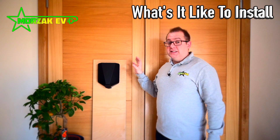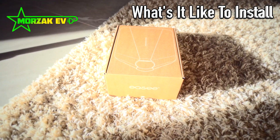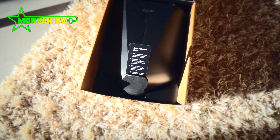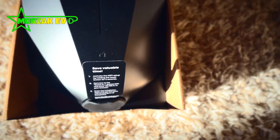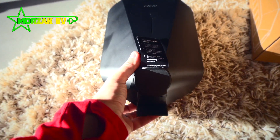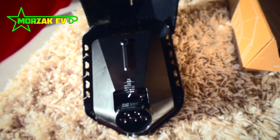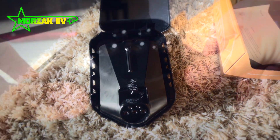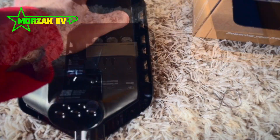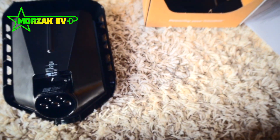For all the installers out there, this is one of the easiest charge points to install on the market today. I haven't got footage of an actual installation, but I've got some footage of me taking the unit apart and putting it back together. Basically you install the back plate, wire your cables in, and then the charge point slots into place and the front cover clicks in. Excluding the cabling, you could install this charger in about two minutes — really handy, makes it more cost effective and swapping units out is super easy.